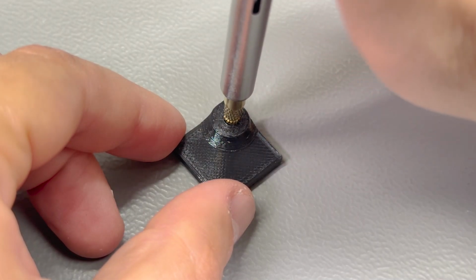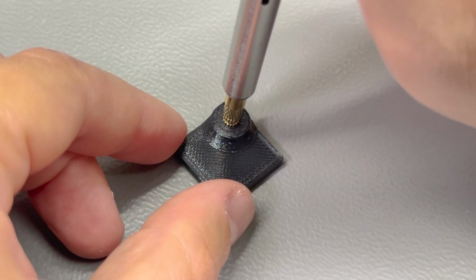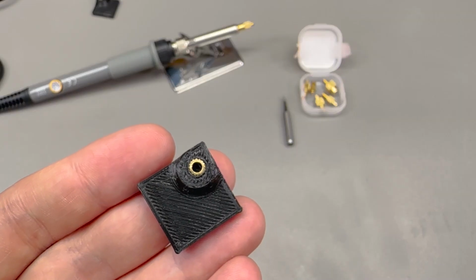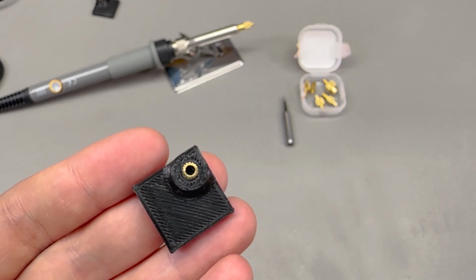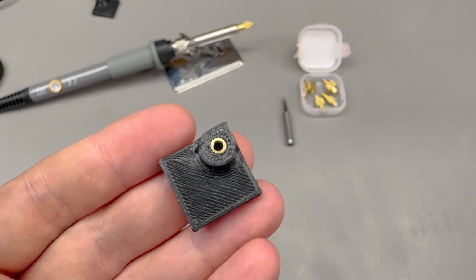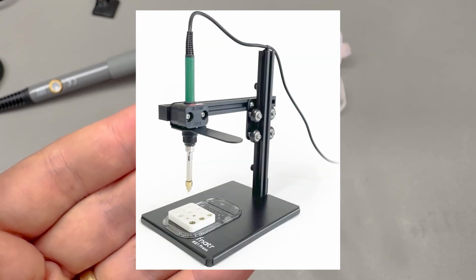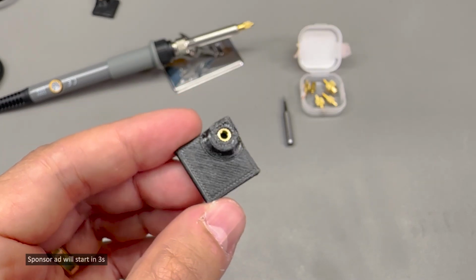Here is a sample of me heat setting a threaded insert with the new tool. It's quite decently designed because it goes through the threaded insert to prevent any plastic flowing back into your insert. So I highly recommend getting one of these sets if you plan to do any threaded inserts. Of course, there are more advanced kits that come in the form of a bench press, which will be superior, but for some quick prototyping work, this will work nicely. And as always, links in the description below.